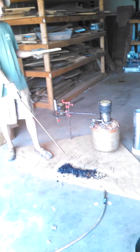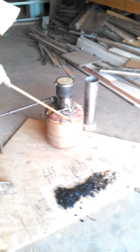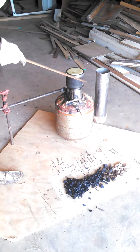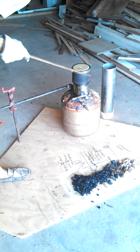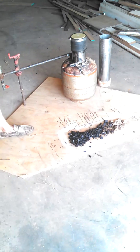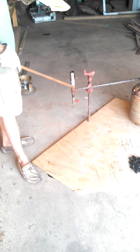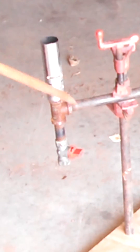Some of the charcoal is also reduced. This white pine often produces less than three percent of ash. This is a pressurized unit, meaning that airflow is controlled through a compressor and introduced here in this manifold. The hopper needs to be airtight to about 10 psi, but it needs to pop off at above 20 psi as a safety mechanism. This carburetor allows a venturi effect to draw air as the gas passes through this larger tube and a nozzle inside, so that we mix a little bit of oxygen with our flammable gas to burn it here.